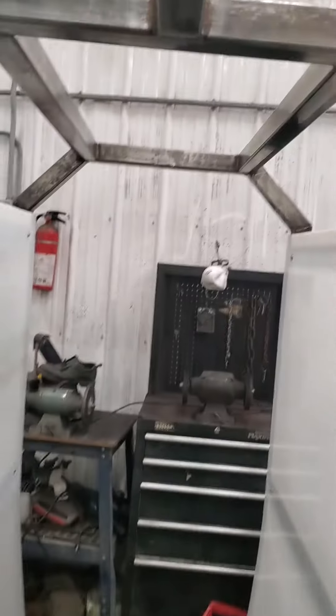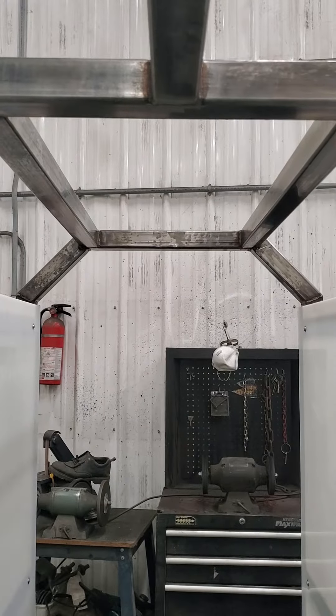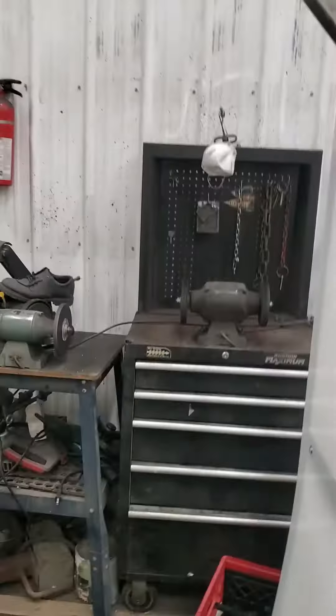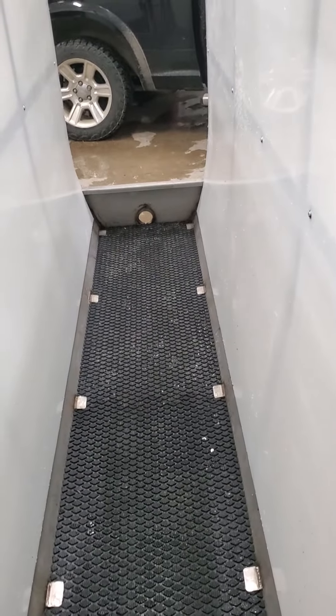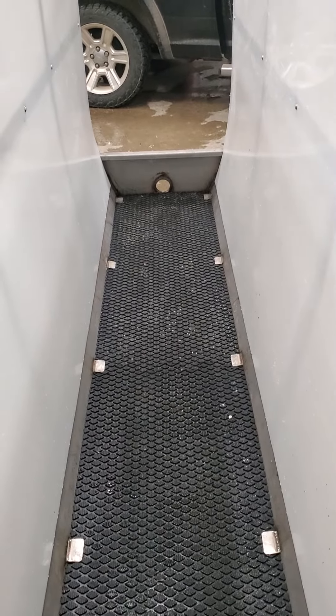At the far end on top we have framed it up so that you can put a 45 or 55 gallon drum up there. Put a float in there set at 40 gallons for the volume of the foot bath, which is the volume we've recommended. It's a low cost volume, yet with the narrow long design of this foot bath you're going to get coverage above the dewclaw.